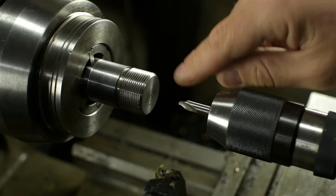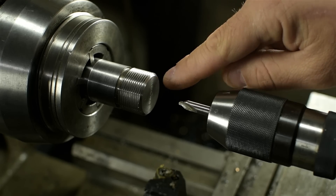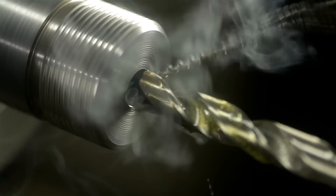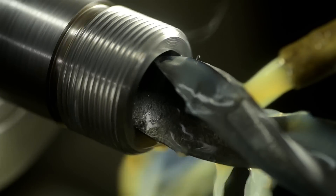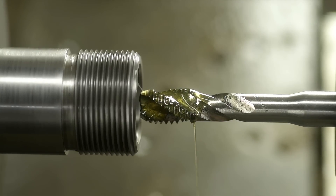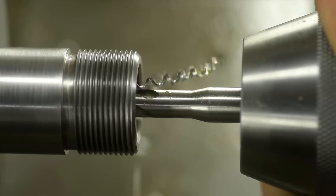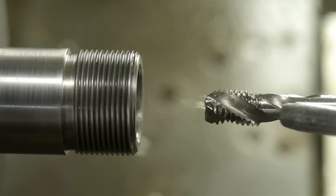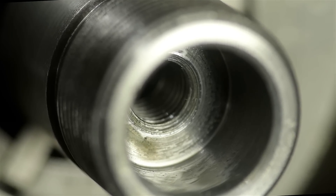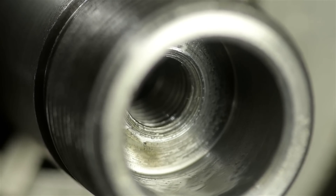Or sign up for my four and a half week thread wire summer camp — limited time offer, only 50 bucks and five box tops from any This Old Tony video. Before I can test fit, I'm going to have to remove quite a bit of material from the inside to make clearance for the crank threads. There's a smaller threaded hole — that's M10 by 1.5. That female M10 has another M8 inside of it, which in turn is tapped M6, which is bored and tapped for an M5, which is then countersunk for an M4.